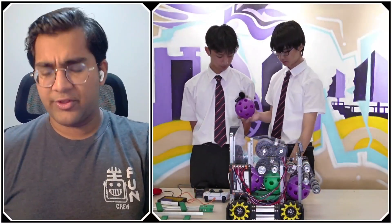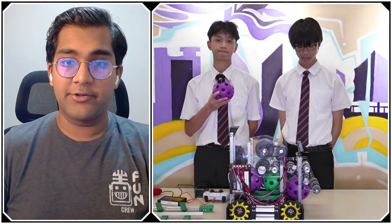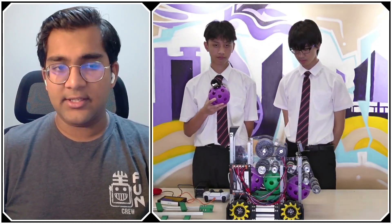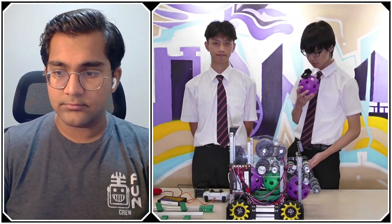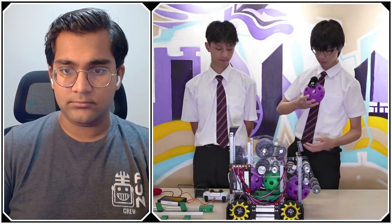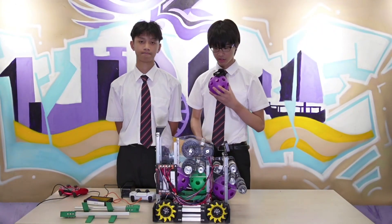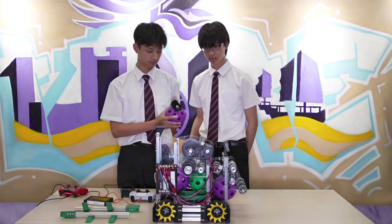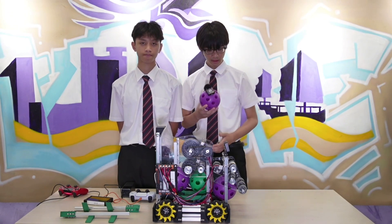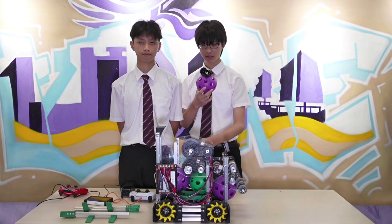As far as the gecko wheel — that's powered with another motor, is that correct? Yes, it's another motor. So talking about your transfer process: why did you go with this gecko wheel design, and do you think teams could get away with a servo-powered system? A servo-powered system is possible, but we decided we just want to make things more reliable, so we went with a motor. The design uses it as an indexer to guide balls to the shooter. The compression is about seven millimeters throughout our robot, in our intake as well as everywhere else.